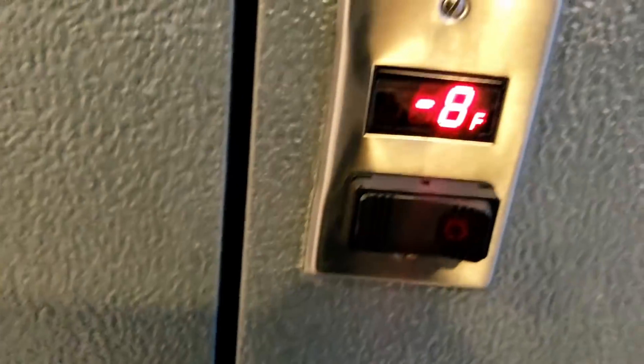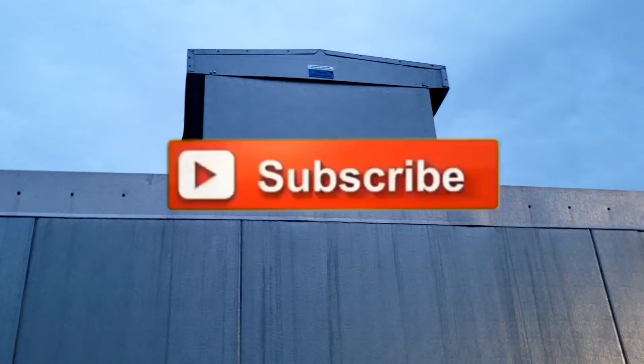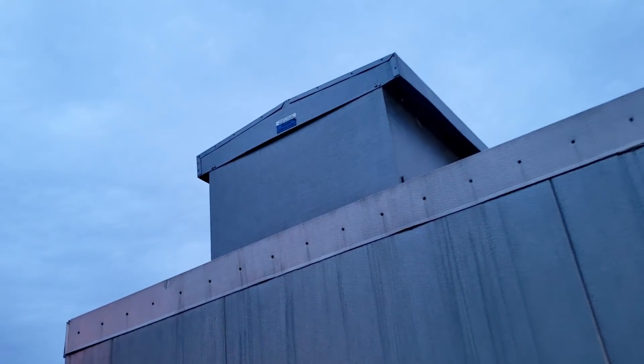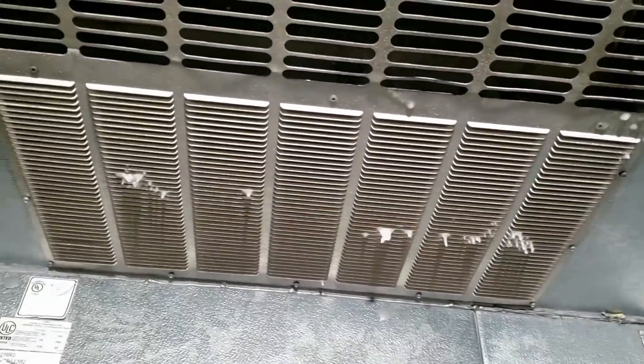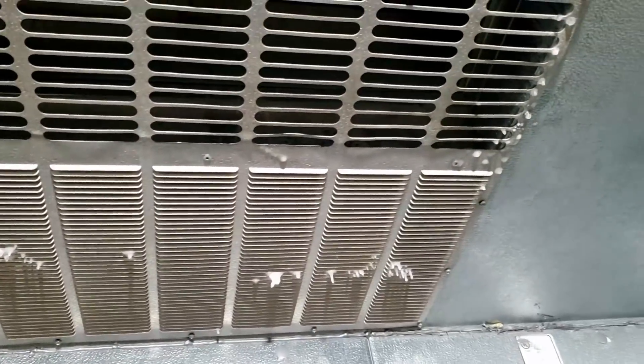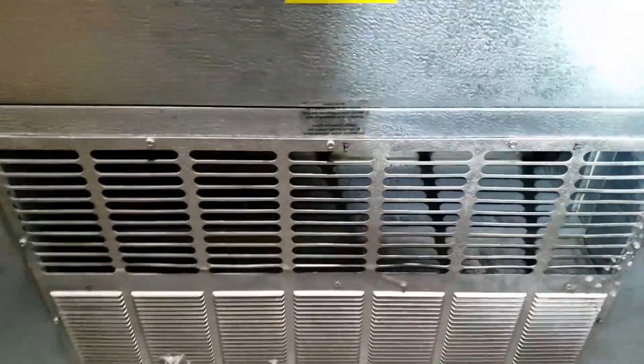It's locked, so let's peek around the back side — I think this one drains down the back. I've had to replace one of the controls in this thing once already. You can see it's dripping down — the drain pan is not keeping defrosted. Looking up in here, the evaporator coil is clean. Zooming in, you can see there's an ice ball right there on the end of the coil. There's a heater right there, so let's go up on the roof — I think it's going to be heater related.